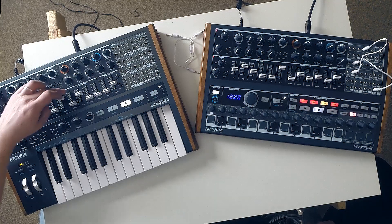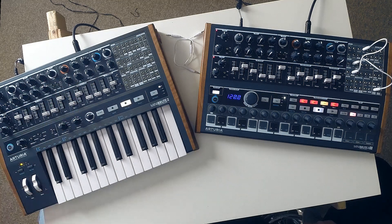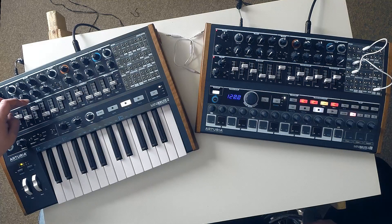Each of these wave modifiers also has a modulation knob, so we can dial in modulation. They're all currently hard-routed to things — any control with a little blue label in brackets under it shows where the modulation is coming from without patching anything in. We've got VCO2, LFO2, and LFO1 available. We also get FM, which is new for the Mini Brute 2, hard-routed to the second oscillator. The original Mini Brute had a sub oscillator — a square/sine sub — fixed to tracking oscillator one's pitch. That's upgraded here for a fully independently tunable oscillator which can also be repurposed as an LFO.